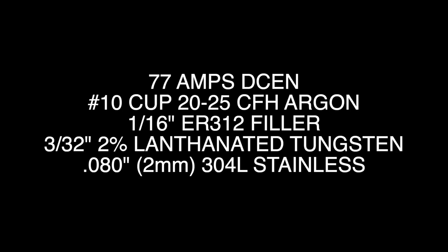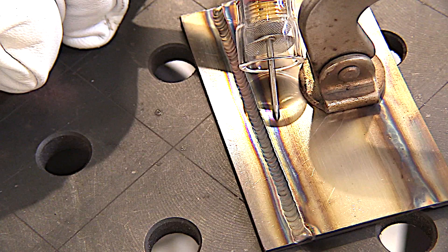Now let's move on to the laser welding. Something really struck a chord with me after watching the demonstration - comparing TIG welding to laser welding as far as the learning curve goes. Let's say you'd already done a little bit of MIG and stick welding and now you want to learn TIG - would it happen on the second or third try? Probably not. But at this demonstration, most everybody had welded before but nobody had picked up a handheld laser, and in just a couple or three tries some of the guys were laying down really good looking welds. The learning curve for handheld laser is a lot shorter than for TIG welding.